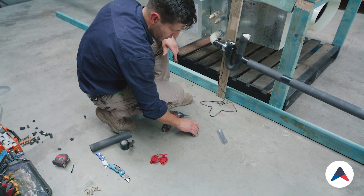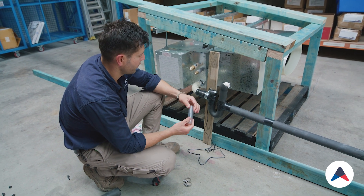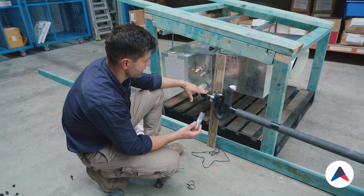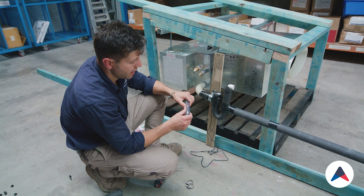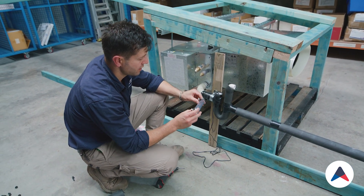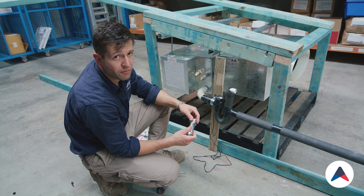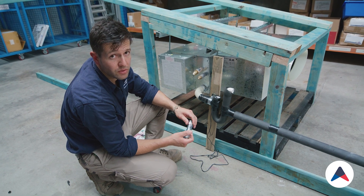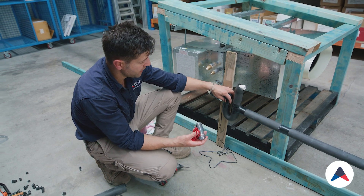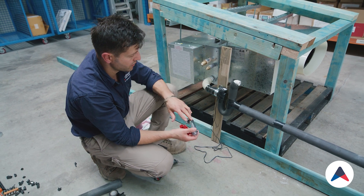The rest of the parts in the kit include some clear hose — that's going to be for a different type of unit. As mentioned, this is a Daikin cassette so it has its own flexible joiner that we can utilize. These are just some clear hoses with clamps, which is another solution, but I'm going with different makes to make it more universal so we can use it on different systems. These are just the leftover caps that came off the P-trap — we're generally not using them anymore because we've obviously made up for those locations.